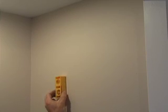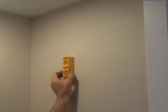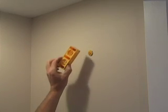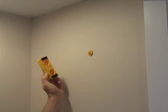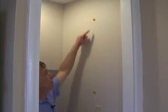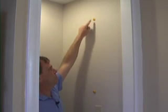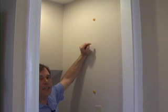After loading your two targets in your holder, simply place the felt pad against the wall and very slowly and evenly rub it across the wall until you hear a clicking sound — just like that right there. That clicking sound is the target finding the nail or screw that is just below the drywall surface anchoring the drywall into that stud. After you find two of these spots in the same vertical line, you know there's a stud running directly between those two points. If you need to hang something on the wall or anchor anything, you know you'll have something solid to go to.